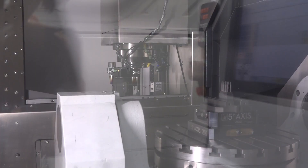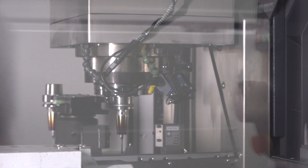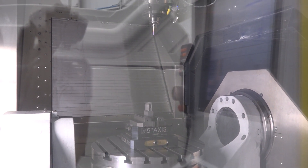0.1 micron — that's incredible. It's somewhat unusual, from all the interviews I've done around the world, to take a machine and say: I can cut anything as soft as graphite — although graphite does rip tools apart — but this machine is built for it, and also cut steel, within just maybe a pallet change. I like that capability to switch from one to the other. If I'm going to run through the night, maybe I don't have to clean out my machine in between graphite and steel — but I might have to. The capability to do that is fascinating.